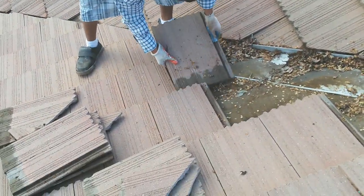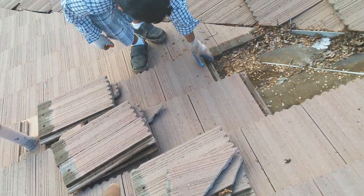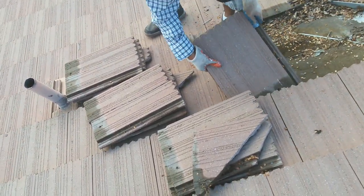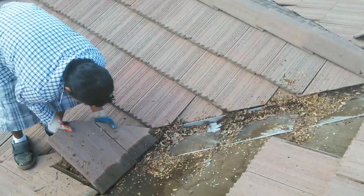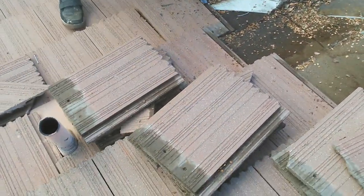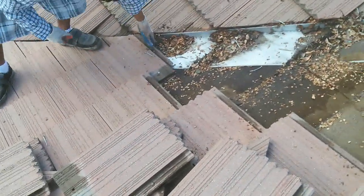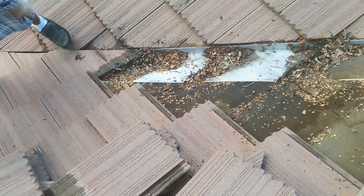See how we're removing the tiles and saving the cut pieces in the same row, so that way we don't get them lost. We're gonna remove an extra tile here so we'll have room to put the paper down. It's a mess — see how much water, see how the paper is damaged. This valley is too small; I think this is the worst valley I found this week.